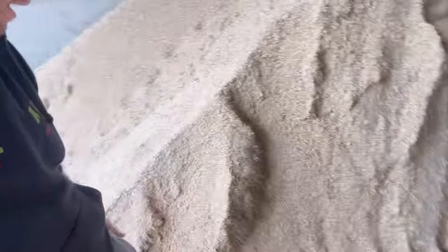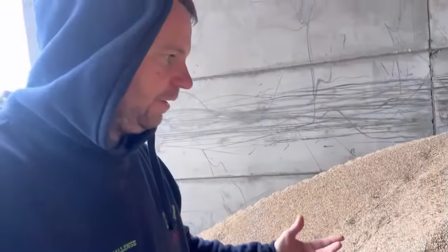When I shot up to Wellbrook to see how they were getting on, they'd started filling the dryer but the agitator jammed - really annoying - so it tripped out. They tried to restart but the belts were slipping, so now discharging the dryer to see what's going on. The grain coming out looks wet but is actually quite fluffy, dustier than it is wet with a bit of soil in it - nothing to do with the bearing we've been messing with at the top. Not a nice job working on dryers - a bit of a shame they'll be doing it without me while I'm on the train to London.